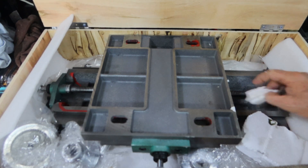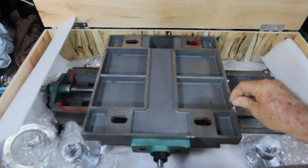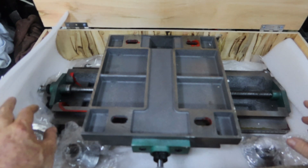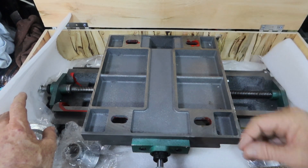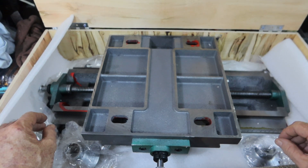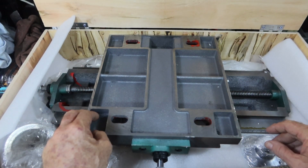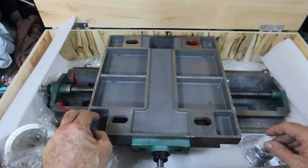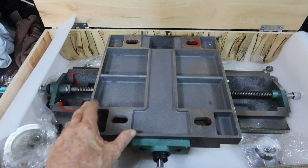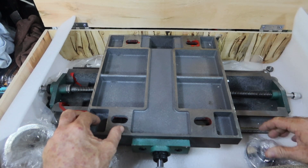It's a cast iron upside-down cake — oh look, that looks like a milling table to me! All right, let's cut the bullshit. This table is 150 millimeters longer than the old one — the old one's 400mm, this is 550mm. It has roughly the same width travel, maybe another five or ten millimeters of width travel. I'm going to have to make some major changes to where it all bolts on, because this is about the same size as the top of the mill with the other one mounted. There wasn't a lot of information online about just how high it was, and I might have issues clearing the bench.